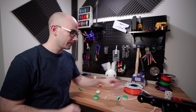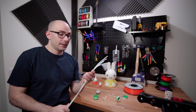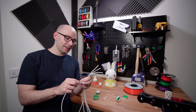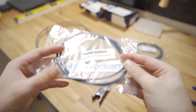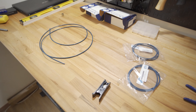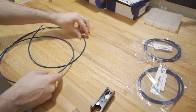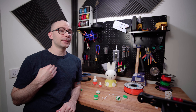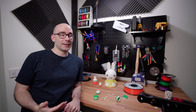Another thing I did was switch out for Capricorn PTFE tubes. The PTFE tubes that come with Prusa's kit — maybe they're good, maybe I just got a bad batch — but I feel like there's too much resistance within them and I constantly had problems. It wouldn't feed correctly. But I switched to the Capricorn PTFE tubes and it feels like there's a lot less resistance. I dropped 50 bucks to get basically 5 meters of Capricorn tubing, and I think that's probably the single best upgrade for this unit because you don't have to worry about your filament getting any resistance from those tubes.